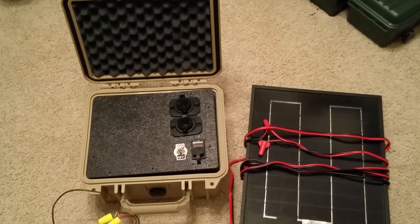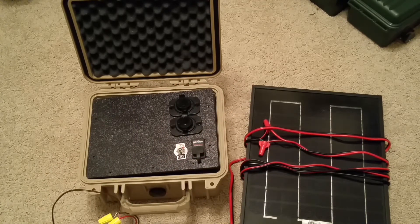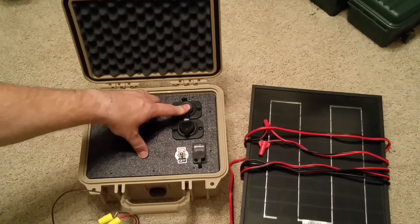I hope this gives you a fun weekend project. It does cost a little bit of money: the battery was about $25, the case was about $30–35, the frame and parts — little switches and such — are all $7–10 each, the charge controller I think was $29, and the solar panel is a 10-watt, probably $25–30. I probably have about $150 to maybe $200 in everything plus some time. It can be wired up in a weekend or a Saturday — not real hard to do and it's fun. You'll have something fun to build and you're getting yourself a little more prepared for power outages.